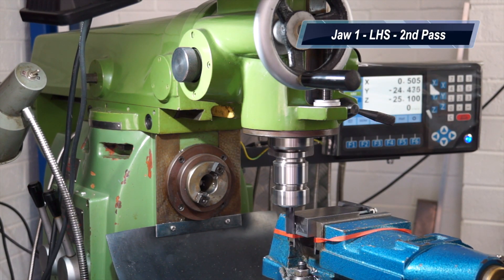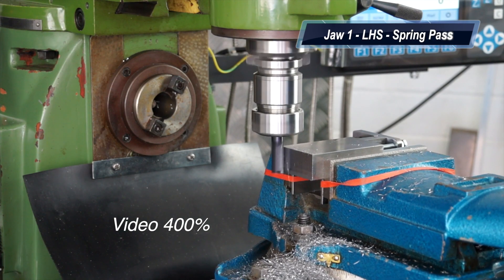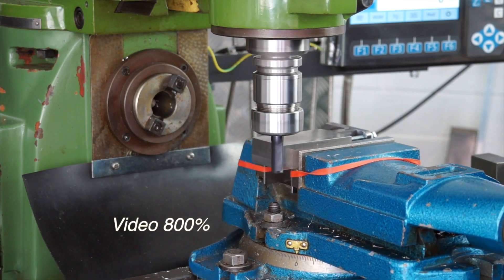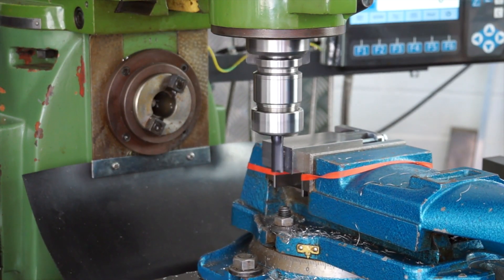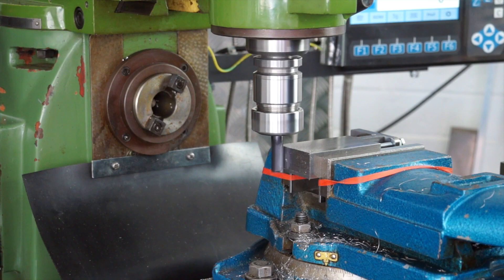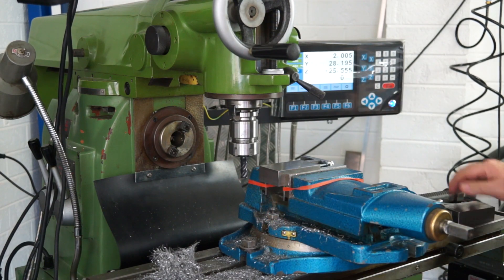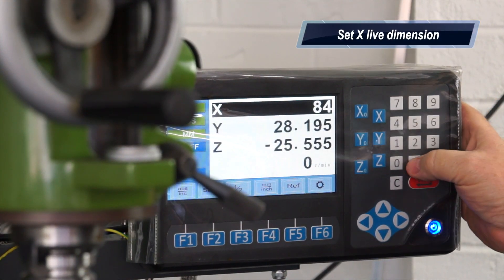The reason we're giving it a lick on one side is just to present a datum edge — that datum edge will go against the stop when I flip it, and I can machine the jaw down to length. There is the vice stop in action. Now the stock size parts I had on hand were about 86mm long, so 6mm had to come off. I've measured 84.9mm and I'll set that as a live dimension in the digital readout.